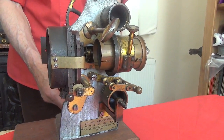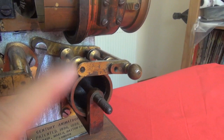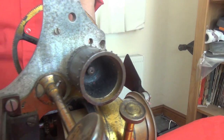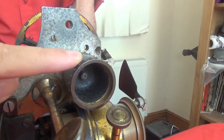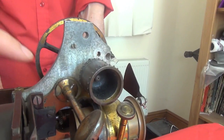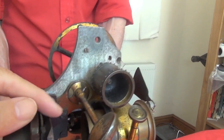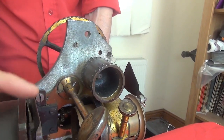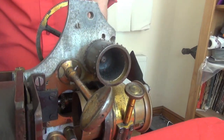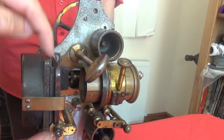The biggest problem in terms of doing that is that, as you'll see, there are sprocket pads, guards, sprocket rollers to hold the film onto the sprocket, and the top one is missing — you can see the holes here where it would have been. That top sprocket, which was an addition they designed around 1895 to 1896, meant that otherwise the film goes directly into the gate, putting a lot of pressure on the film as it comes down with the weight of the film on the spool. This is where the Latham loop would have been, which takes that pressure away and then the film comes off the spool. We could still use this as a projector by having the film go directly into the gate and missing the top sprocket, and it projects very happily.